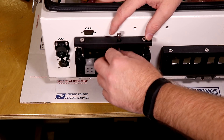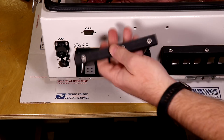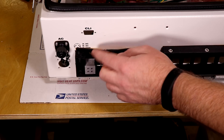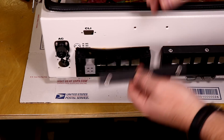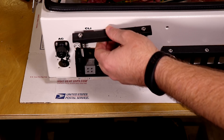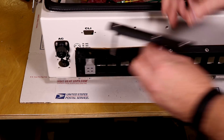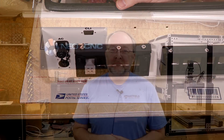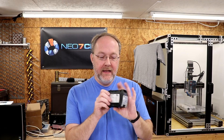This system gives you modularity. I like to separate any I/O from the power in as well as the servo power out — I/O on one side, power on the other — which makes for a clean installation. You can stack up two grommets in each channel and then put your cover back on. Be careful not to pinch the gasket. The gasket has adhesive on the back so you can anchor it and cinch everything up for a very tight seal. These are the lower-rated dust-resistant ones, which is more than good enough for what I'm doing.